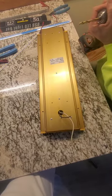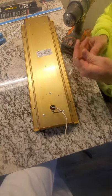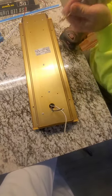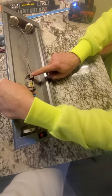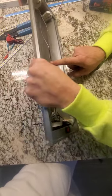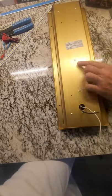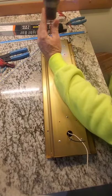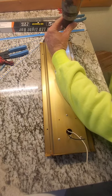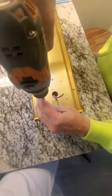To do that, put a drill bit in — this is a quarter-inch drill bit. I tried smaller but the rivet ends keep getting caught. Now there is a post in the center here; this is the rivet you do NOT want to drill out because you won't have anything to mount your deflector onto. So the center rivet you leave. The others you'll see come out pretty fast drilling them out — you've got two on that side and three down here.